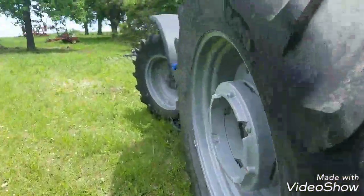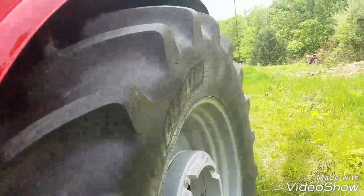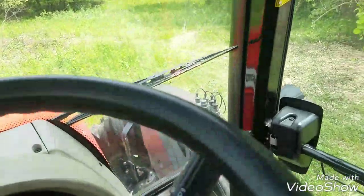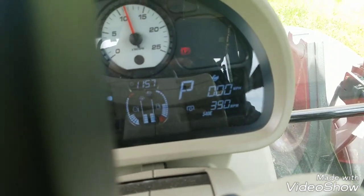That's how it shows us doing it in the user manual. My guess is that's how you do it on an engine-driven one, where you can disengage the PTO but still have hydraulics. On the tractor ones, the only way you have hydraulics is if the PTO is running, which means the flywheel's running. So I still do it the same way because I don't have a lift. So we idle it back a little bit, now we'll get it way back.